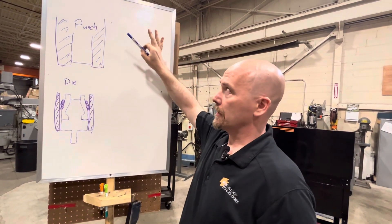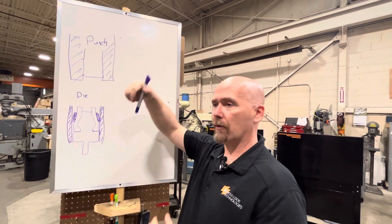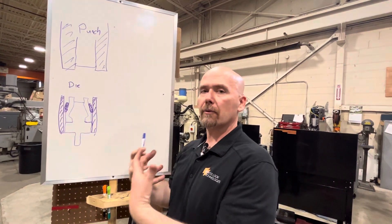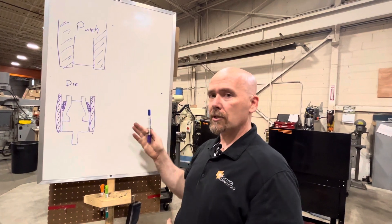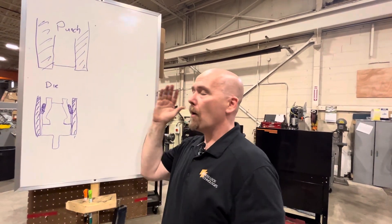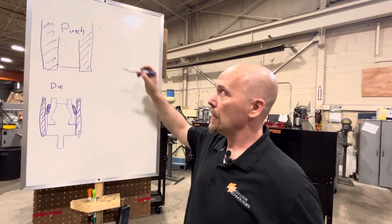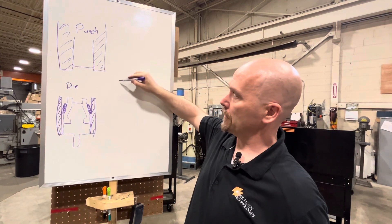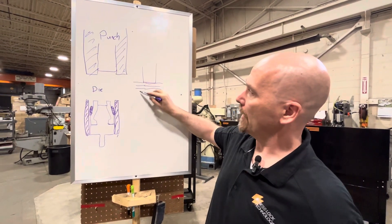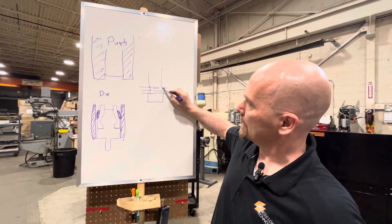With the tooling, the important things are that on the top layer of material — the layer that we're driving — we're going to have a punch, and on the bottom side, the receiving side, we're going to have a die. The punch and die come together, they clamp the material, and then the magic happens. When the punch starts to enter into the material, it's actually going to draw material down into a pocket. The punch captures material — we have two or so sheets of metal, a punch going in, and a pocket which is the die, and we're moving the material down into that pocket.